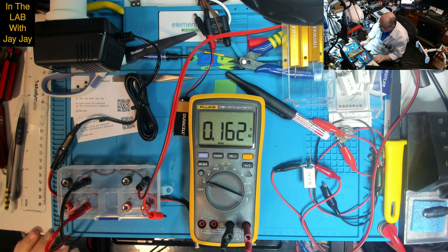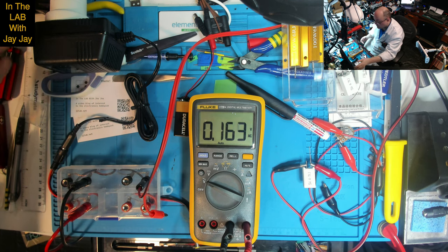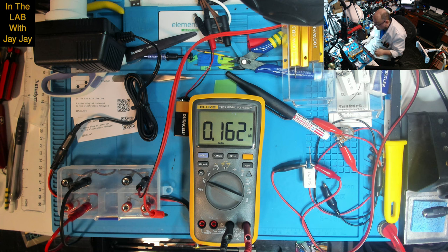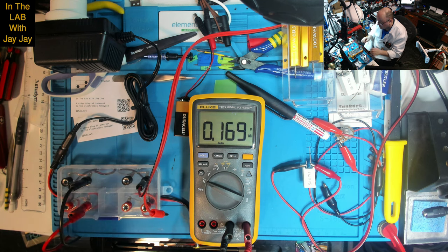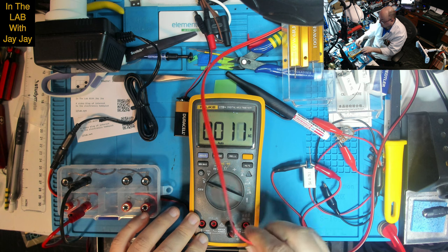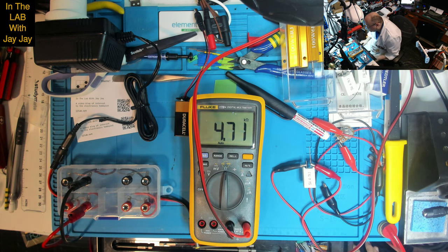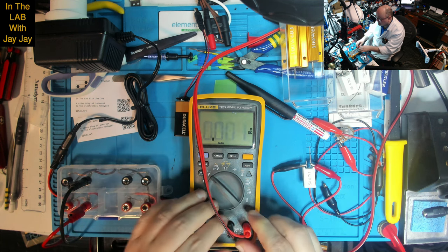We might come back to AC later when we do current measurements. Let's move on to voltage DC, which I'm more qualified to work with. We already saw this briefly. Before we leave, I'll take out the probes and measure that resistor to confirm it actually is 4.7 kilohms. Yes — reading exactly 4.7k, right on spec.